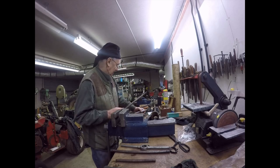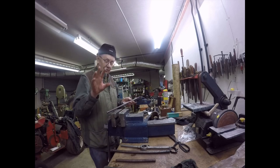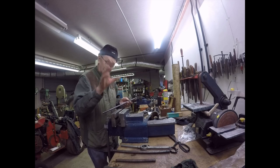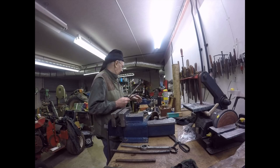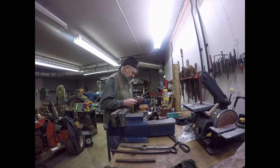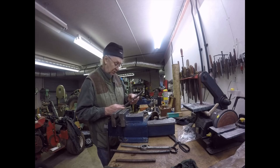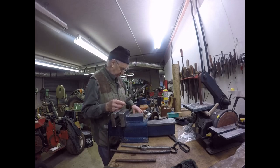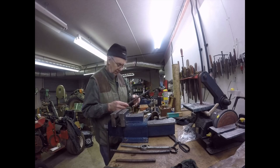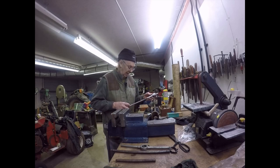When I came in this morning, I realised that I need to now create a short UNC drawbar. I might be telling you all this twice, because if the first piece was okay, then I'll put it in. But there's the short drawbar that goes through the vertical head. That's a smaller Whitworth thread, which fits these two Clarkson auto lock collet chucks, for which I have no collets, unfortunately, or very few anyway. I haven't got a half inch one, that's all I need. So I found a piece of bar, and I've put a lovely thread on the end with the UNC die that I got from eBay. It's made a beautiful job. Started it in the lathe. I've turned it down to a half inch in the lathe to make it fit.